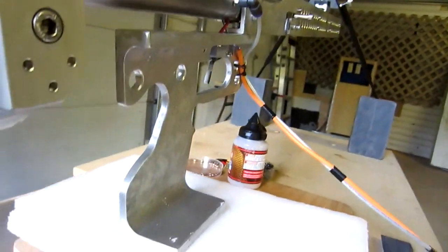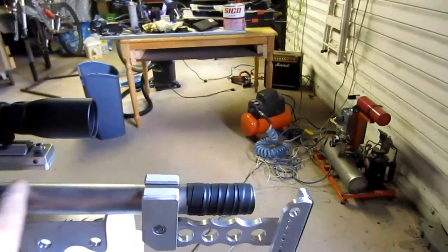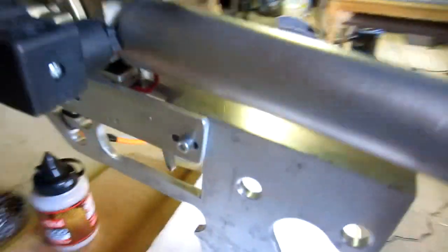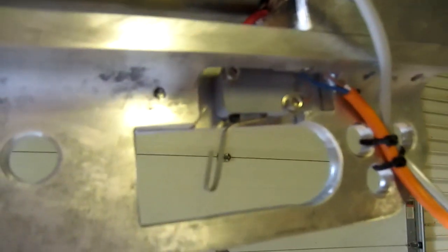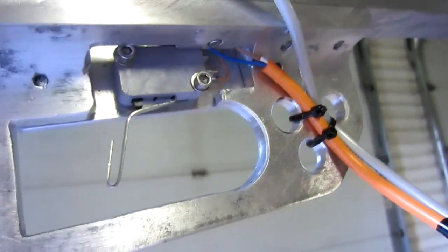The grip is a big piece of aluminum channel that I spent a lot of time shaping. This is the chamber — stainless steel which I welded up — and a 24-volt DC solenoid valve. We have an electronic trigger: just a little micro switch with an arm which I bent, making a nice little trigger shape. Virtually no trigger pull at all — it's just a switch.